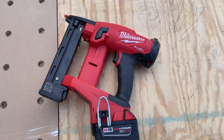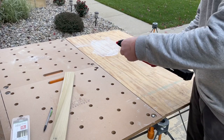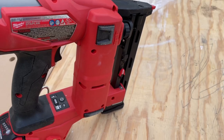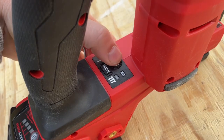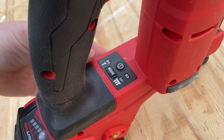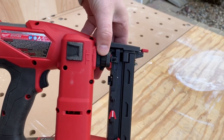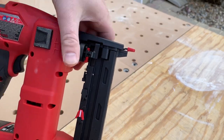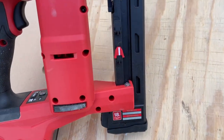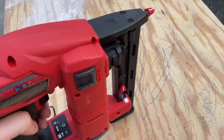The Home Depot sent out the newest Milwaukee 18 gauge stapler this quarter as part of their Prospector program for me to check out and share with you guys. If you're a subscriber of mine, seeing me use Milwaukee nailers is nothing new, and this stapler is just as impressive. It's a very similar design to the brad nailer except it shoots staples. It features an on/off button on the base that stays on for quite a while so it's not annoying having to turn it on every time you pick it up. The mode button cycles between single or bump fire, and it has a tool-free drive depth adjustment so you can fine-tune it depending on your material. I really like the small precision tip — it comes with a spare stored right on the gun. The LED light wasn't doing much working outside, but from experience on the other nailers it's a really awesome feature to have.